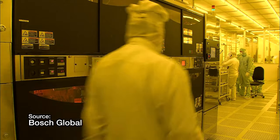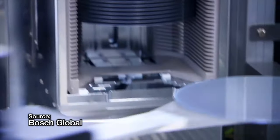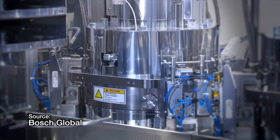Practices haven't changed. Every silicon foundry has been doing this for decades and will most likely continue to do so for years to come, because it's the most efficient way to get multiple product SKUs out of a single process. It's also better for the environment because you can get multiple products from a single process instead of needing an individual machine drawing power and taking up space for each individual product SKU. And while this video has been focusing specifically on CPUs and SoCs, this is also the process for any silicon product — GPUs, SSDs, RAM — all of that uses a very similar, if not the same, process.